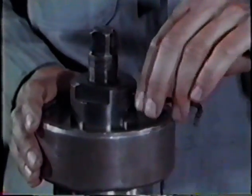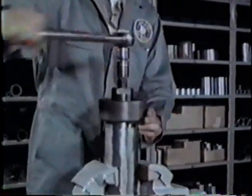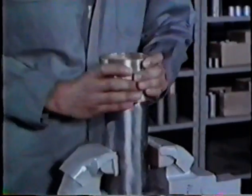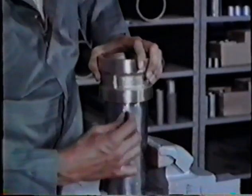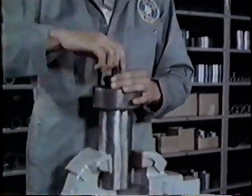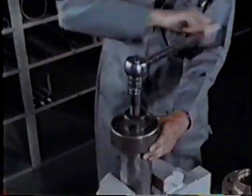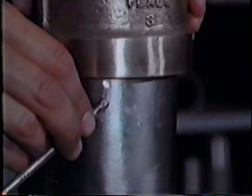Now, loosen the set screw, and without restraining the thrust nut, turn the mandrel, remembering the number of turns you make. Make the turns you think are required for the needed expansion, then reassemble and gauge the joint. If more expanding is needed, again insert the tool. Turn the mandrel as needed. Then lock the set screw to avoid further expanding, and rotate the rollers several times for final rounding and sizing. Make a final check with the feeler gauge.